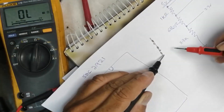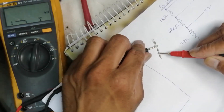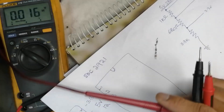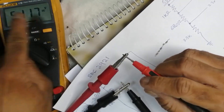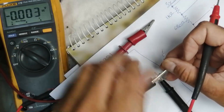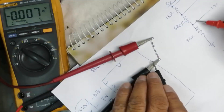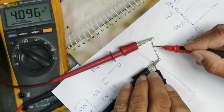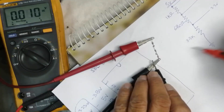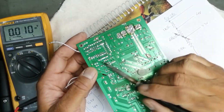So I made three components — three resistors. The first value is 3.3k, the second resistor is 0.7k (680 ohm), and the third one is 1k. With 5 volt external standby power connected, if I check voltage at the first point I will take 3.3 volt, at the second step 4 volt, and at the top of this resistor 5 volt. We will connect the bottom to ground, standby power in, and free pin number one by removing the resistor from it.